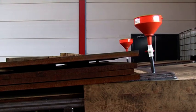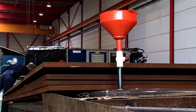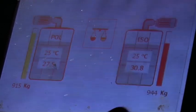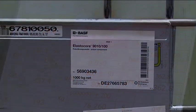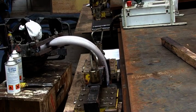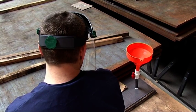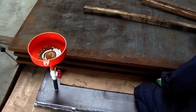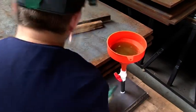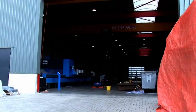The empty SPS panel is placed on a sloped injection bed and restrained during injection to control the deformation of the faceplates. Using specialized equipment, the liquid elastomer is injected into the cavity until the panel is full and comes out of the vent holes at the top end of the panel. The injected SPS panel is left to cure for four hours until the elastomer core is hardened.